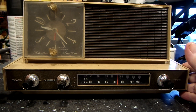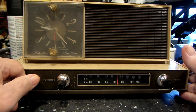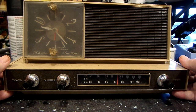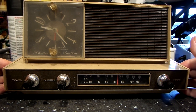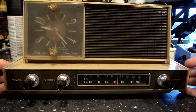That's up all the way. So obviously it's suffering some loss of capacity in its coupling caps. So we're going to have to go through and troubleshoot that. And we'll replace the filter caps as well. That just goes without saying these days.